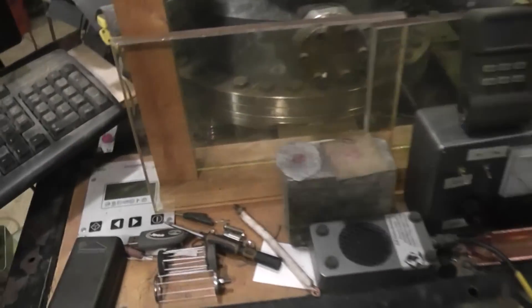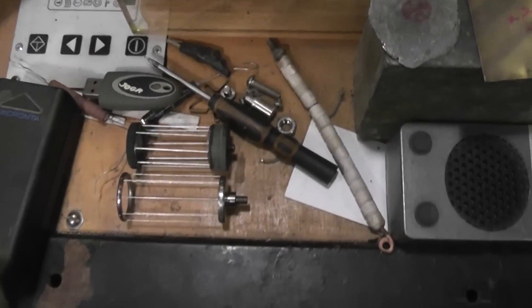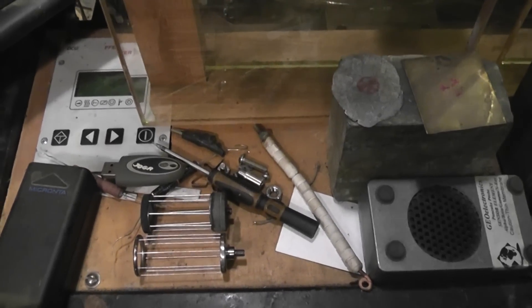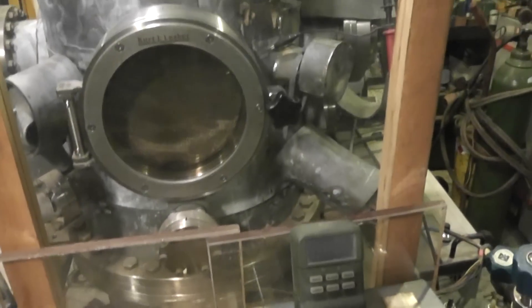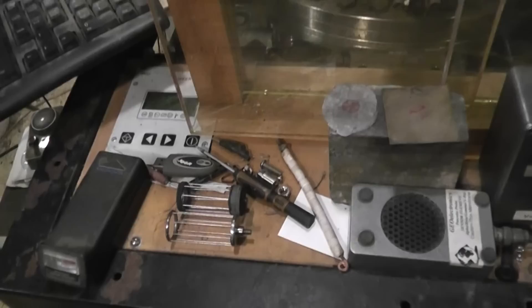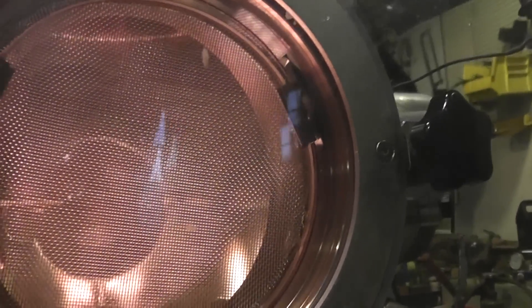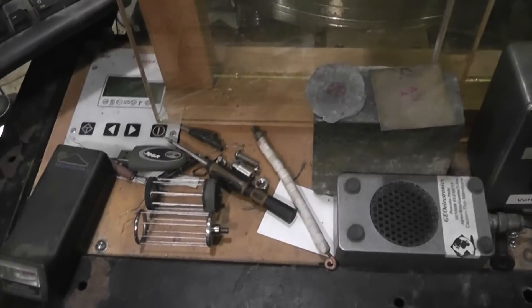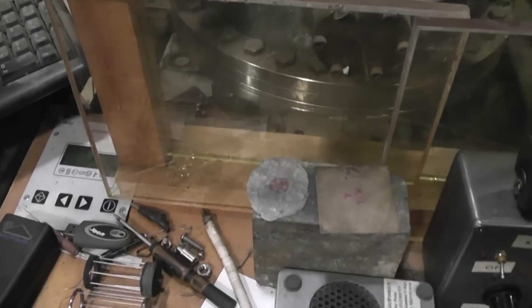Most people who make fusers just make their grids with a random wire orientation. You'll notice here that we're using cylindrical grids and the orientation is very much not random — they're cylindrical electrostatic lenses. Anything that has electrodes with a high field on it is an electrostatic lens, and the question is did you make a good one or not? Most spherical fuser grids, or our little ion source grid here, suck as lenses. Whereas these are pretty good, but they're not even up to optical standards, and what we really need is better than that — more like electron microscope standards.